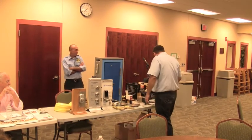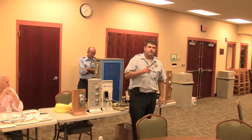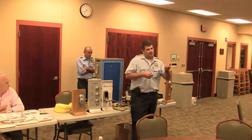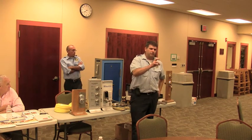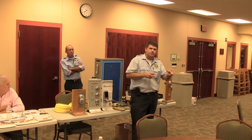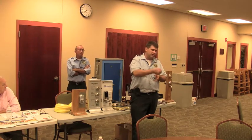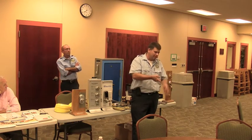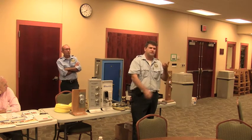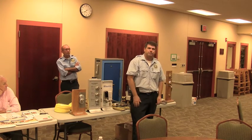They make a deadbolt that's a little tricky — there's no key on the outside. It's just a thumb turn on the inside. So if you're home and you want a little extra protection, you can add another deadbolt to the door with no key on the outside. You drill halfway through the door, put the deadbolt on — it's got a thumb turn on the inside and nothing on the outside. You don't even drill through the door. It just looks like a regular door with one lock, and you have a thumb turn on the inside. I've done that for houses and businesses as well.